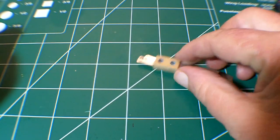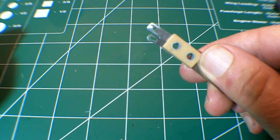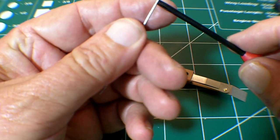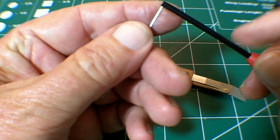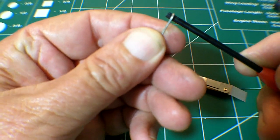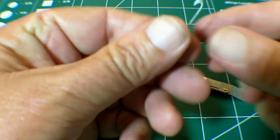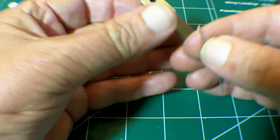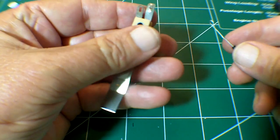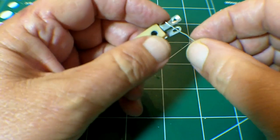While in most cases you'll have enough room in the lug to put both the wire and the diode in place, you'll come across some small holes. The best thing to do is to take the diode lead, use your solder pick to twist it into a J-shape, put it on the lug, and wrap it around one full revolution. Clamp it down with a pair of needle nose, and then you can solder it to the lug instead of soldering it through the hole.